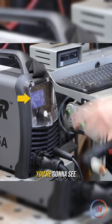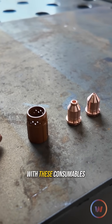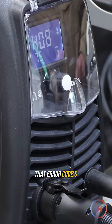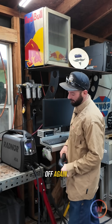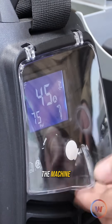If you go ahead and loosen this a little bit, you're going to see an error code pop up — that's really common with a lot of plasma cutters, just saying that something's going on with these consumables and you don't have them in there properly. Just for fun, we're going to be switching these nozzles out. That error code won't relieve itself until you turn the machine off — this one does, but most of the time you have to cycle it on and off again for the error code to go away, which is really nice because that's a pain. We have 45 amps coming into the machine, all the way up, the mode selected properly, and enough PSI coming out of it.